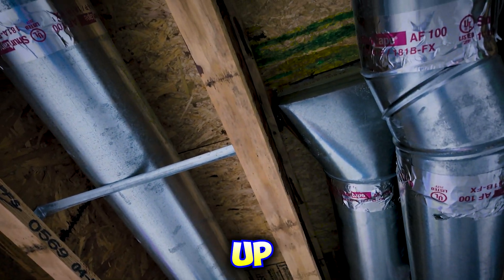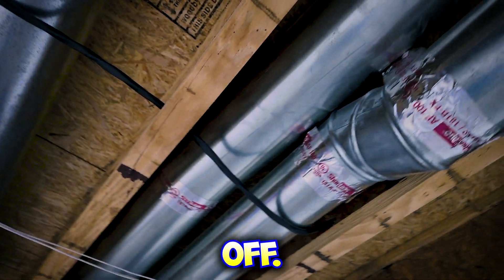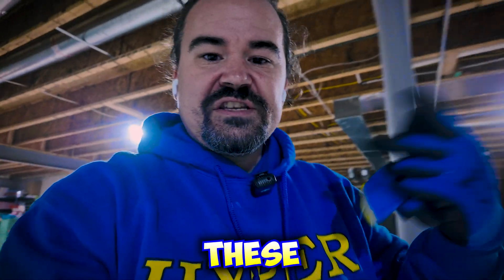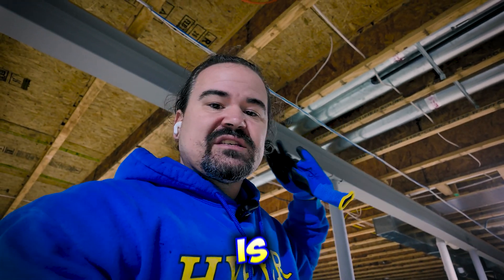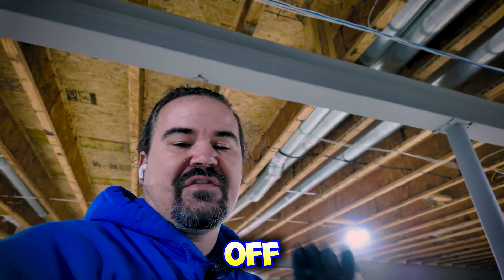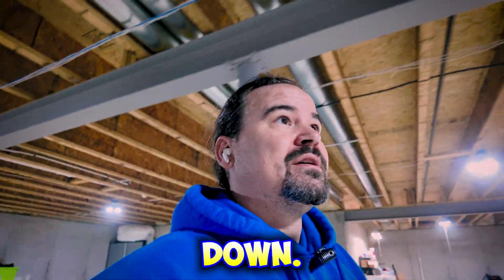See how that one goes straight up through the wall cavities? Someone tried to tape this stuff off — it's not very impressive, and you can actually see it's falling off right here. But that's okay. These clients are getting their ductwork sealed, and even with the tape on it, the glue is going to push that tape off, get right through that crack, and lock it down.